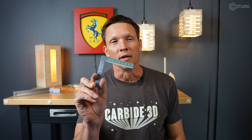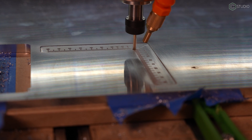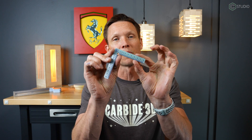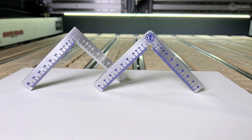This was version number one. It had some sharp edges to it — it was okay. It had a reasonable size hole for getting the actual corner of the object you're trying to measure right into the corner. Here is number two. It has three filleted edges around the sides, which made it a little friendlier, a little bigger hole in the middle. I think actually that's too big. I did a little chamfer along the top edge on the outside to refine that. This turned out pretty nice — I was really happy with this, so I took it a little further.